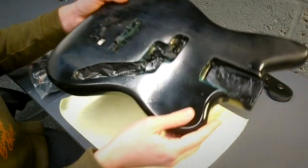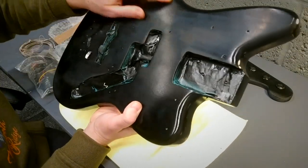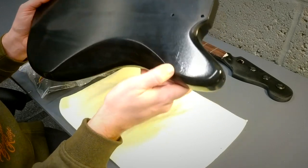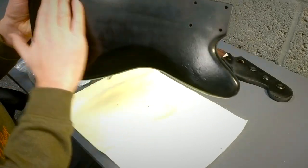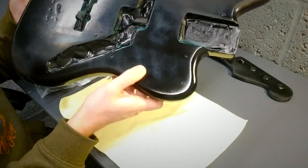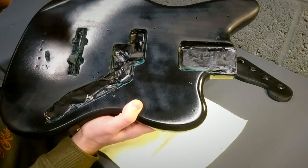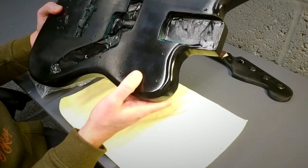The body - he said there were a few holes in this as well. I'm not sure where they are, I think I can see one there. I think he was on the right idea in terms of painting it. I'm going to rub it down a little bit more, smooth some of this stuff off. For people who paint guitars - you don't need to rub it back to wood, you only need to key the surface. Make sure it's all smooth, smooth out any bad bits, and then just key the surface so the paint can stick. I may not even use primer.